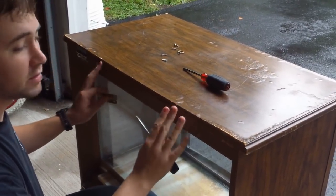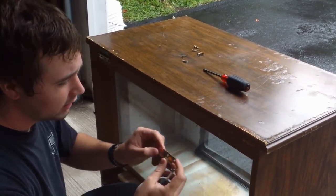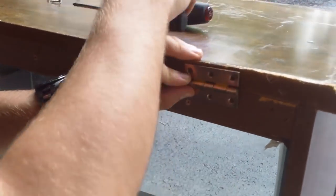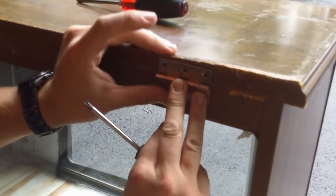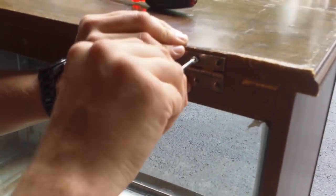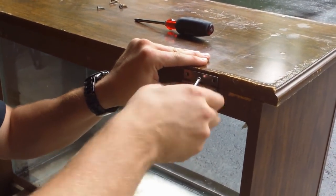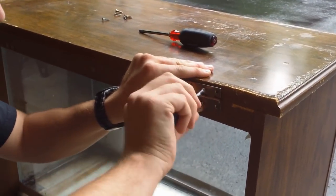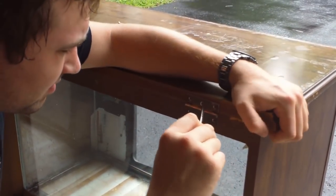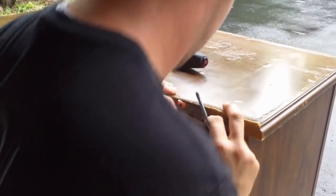Always put the lid on exactly where you want it, then put the hinge on with it at the dead center of the break between the two pieces. I've already taken a knife and poked holes where I want the screws, just to make it easier to start them. If you're buying a pack of hinges, it'll come with better screws than what we're mixing and matching here. The key is we're putting the hinges on while it's sitting where we want it — not taking it off to a desk.